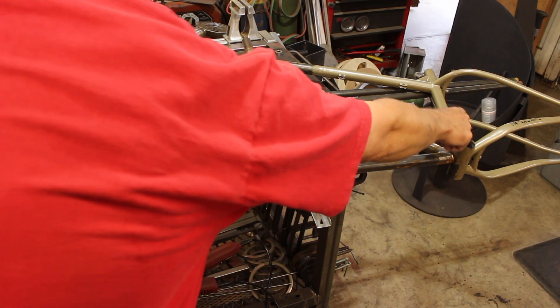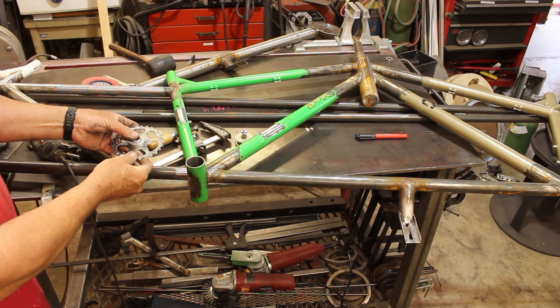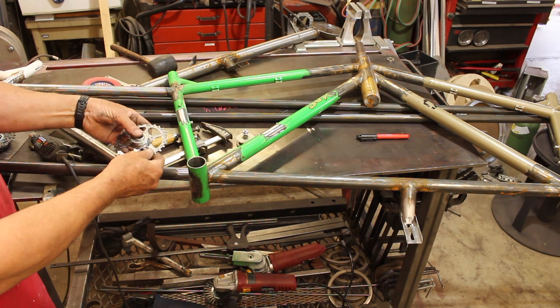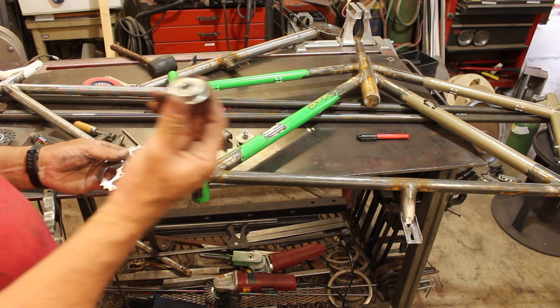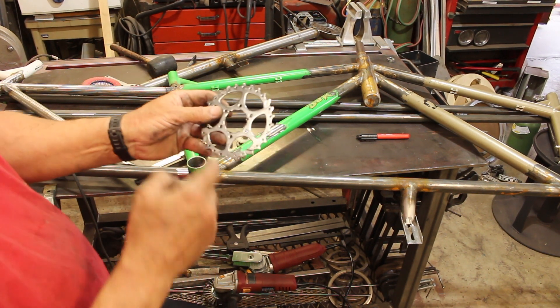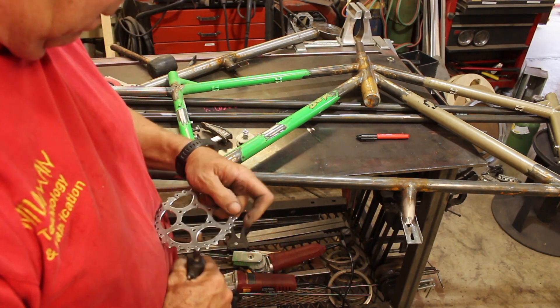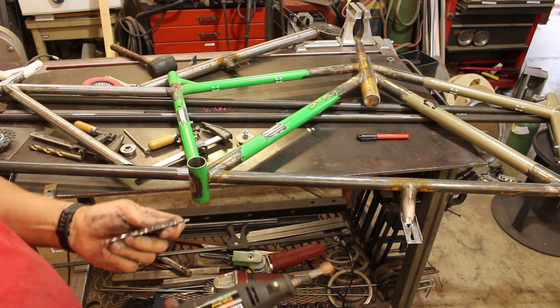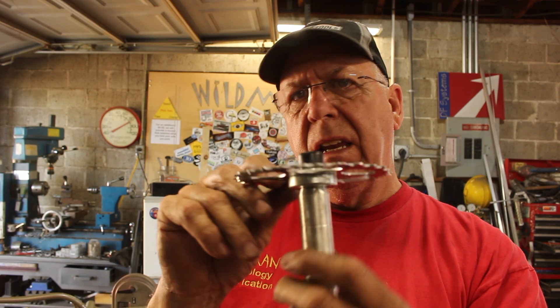The way we're going to do it now is come off the top of the back sprocket, come down underneath the middle sprocket, then put this sprocket up here to change direction again — off the top, underneath the bottom, over the top of this, and onto the front. This is the bearing I have, and the hole is too small so I'm going to enlarge it. Here's my sprocket pressed onto the bearing. I'm probably going to tack weld the sprocket onto the bearing, turning it into a disposable part, but it should survive the process.